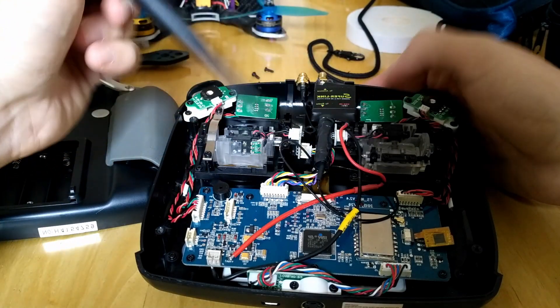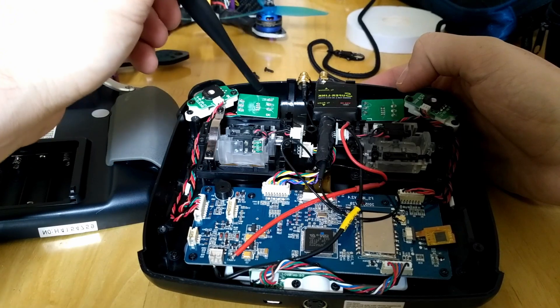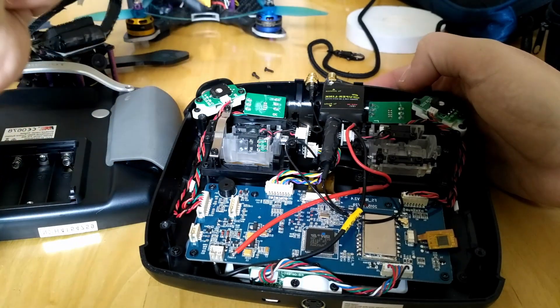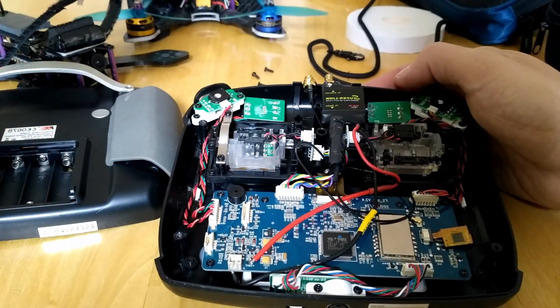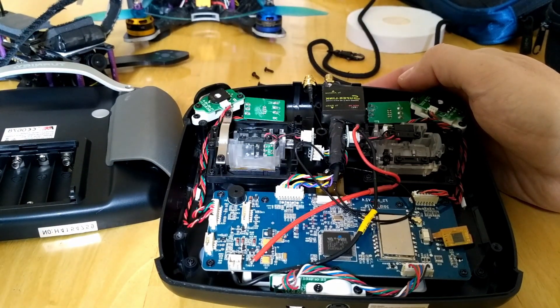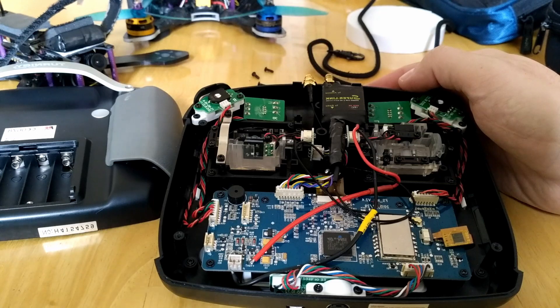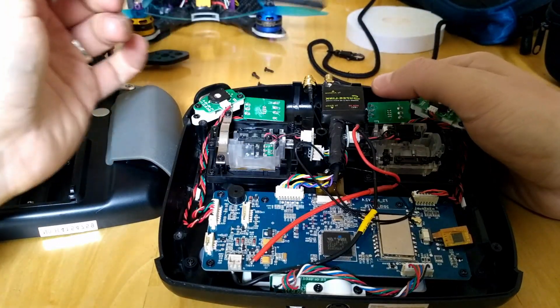I had to cut a little bit of plastic inside. This radio had two built-in internal antennas located somewhere around here, and I wasn't getting much — only about 200 to 300 meters of reception. If I went behind a tree, behind a cliff, or anything like that, I was just getting failsafe. It wasn't flyable — I broke a lot of cameras and parts, so I decided to go for this mod.